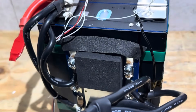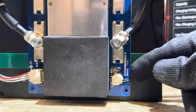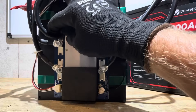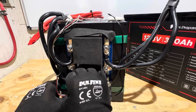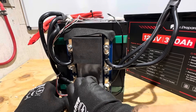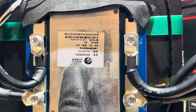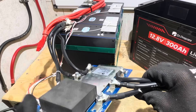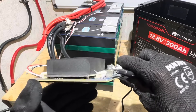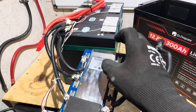Spinning around to where the BMS is located — that appears to be a SideHang Technology board, and here's the model number. All connections to the board are extremely tight; no issues with any loose wires. SideHang boards are decent overall — they're a little generous on their over-current and surge ratings, so it's a decent choice if you need a battery that can handle a good current hit. I pulled the foam off the BMS heat sink — it is a MotCell-branded board. It has a nice thick chunk of aluminum on the bottom and an aluminum heat sink on top, so it should dissipate heat very well.